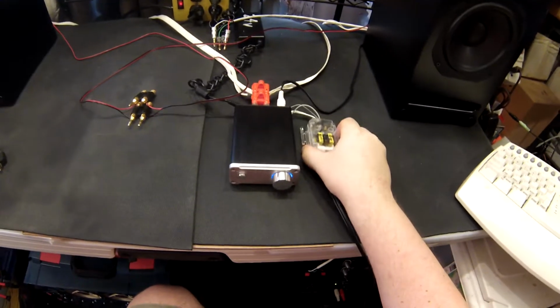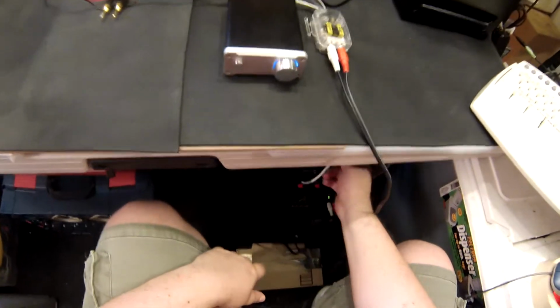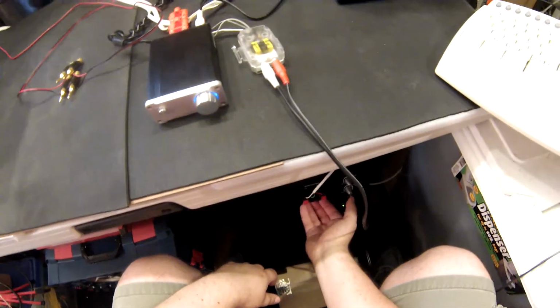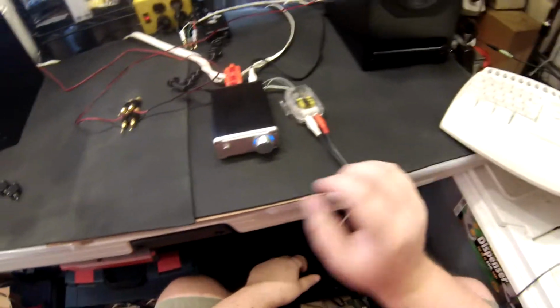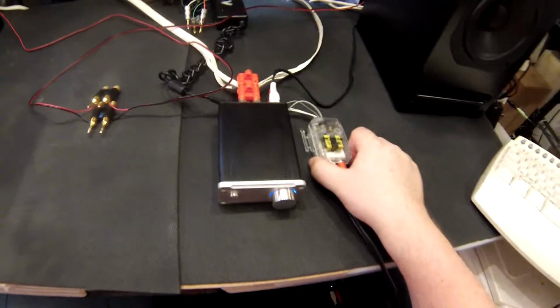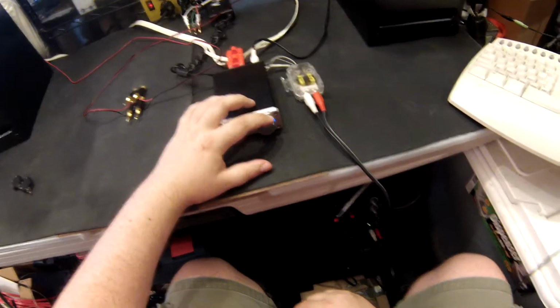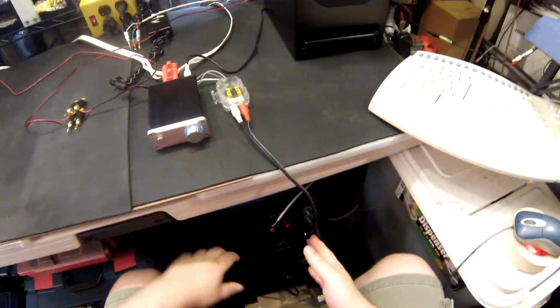And this box will give a higher signal to the RCAs than you can get otherwise. In other words, this box is built into a subwoofer. That's what these connections are. One of these lives in here. But for some reason, and I don't know the reason, the gain controls that are built in are not set high enough. So when you have really efficient speakers and are using a low power amp, it just doesn't make the sub go. So now that you're using line-ins, you can, just like you were before, adjust this, and that is doing its thing. And it's doing it at half gain.